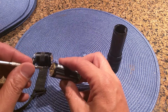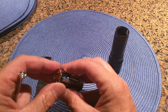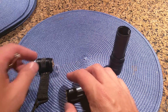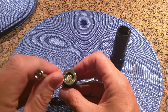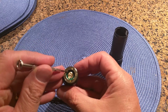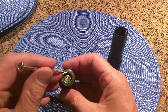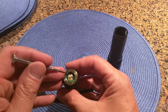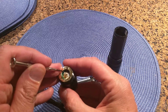To fix it, I just unscrewed the top, took three screws off the tray, removed it, and cleaned the surface — there was definitely some battery acid in there. I wiped it down using a little rag with some vinegar on it. Then I looked on the inside of the push button — the actuator — and there was also some acid accumulated on the insulating ring. I scraped it off with a screwdriver and a little bit of vinegar on a napkin to clean it up.